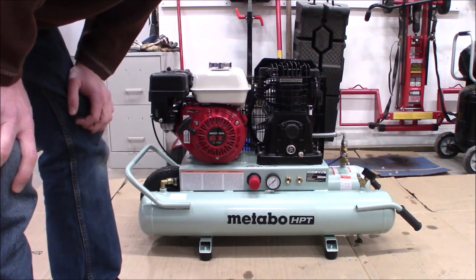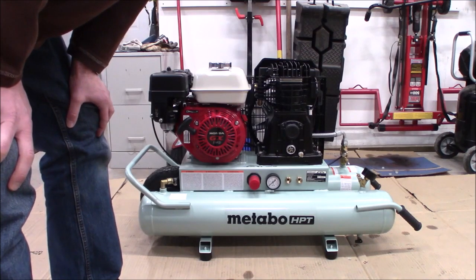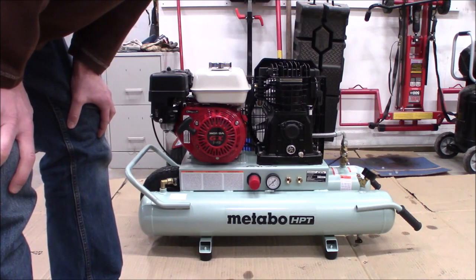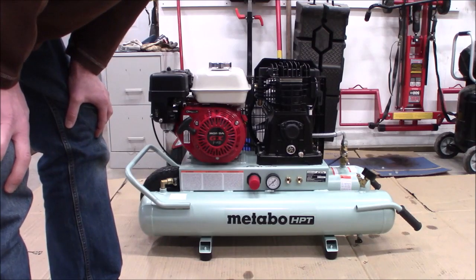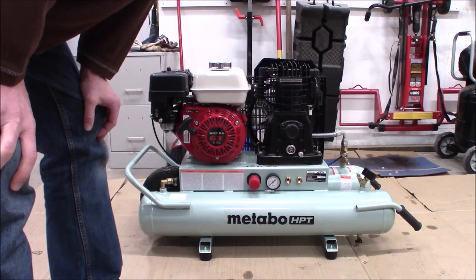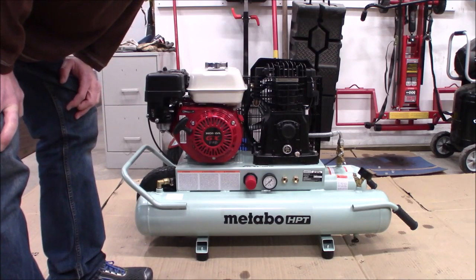With the compressor oil, you need to follow kind of the same rules as you would for the engine. If it's sitting out in the cold, you don't want a thick, heavy oil — the manuals generally cover this pretty well. You can go down to a 5-30, or run a straight 30 weight if it's warm outside. You can run a multi-weight like 10-40 or 15-40 if it's really warm. But if it's really cold and the unit has been sitting out in 5-degree weather overnight, starting it with straight 30 weight is going to cause lubrication issues. Keep an eye on your oil level and change it relatively often if it starts to get discolored, and change it based on weather conditions.